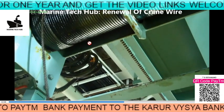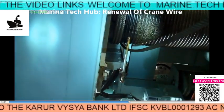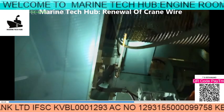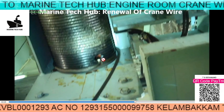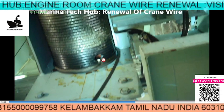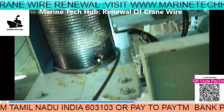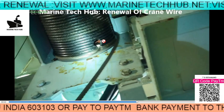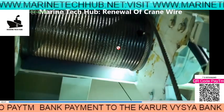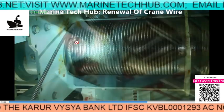Once you remove the cables, then you can see the slots. I am explaining you in full detail so that you can understand what you really have to do while changing the cables. So if you see here, this is the slot — you have to put the slot here to the end of the cable and push it at the other end so that it is in the locked position. Then you have to turn the drum in such a way that all the wires are coming into the slots here neatly. This is very important — you can see both the slots here in place.